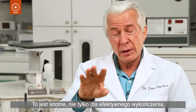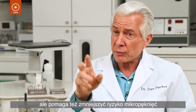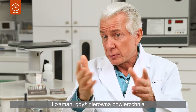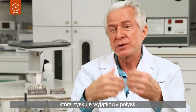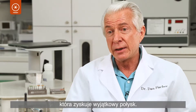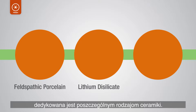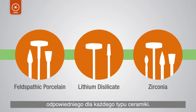This is important not just to provide the ultimate finish, but it helps to reduce the probability of microcracks and fractures — a rippled polish surface can be more conducive to micro fractures than a perfectly blended smooth surface which then receives the ultimate shine. And to date, most systems for handling these different ceramics have been specific to individual ceramics, meaning you had to have a multiplicity of different types of grinders and polishers relative to the type of ceramic you were dealing with.